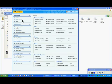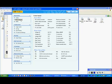Next one, printer sensor. It's going to tell you about the sensors of the printer. It's a little bit dynamic, so for example the temperature here can change, depending basically on what you do with the printer and so on. And just to be sure that you print with the yellow panel, you should have here the tricolor state, which is the color sensor. It should show you yellow panel. So you know that the next panel to be printed on the next card will be the yellow panel, which is the good sequence: yellow, magenta, cyan, and so on.